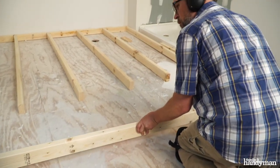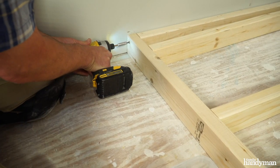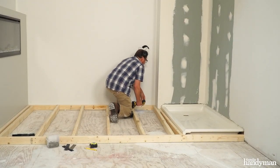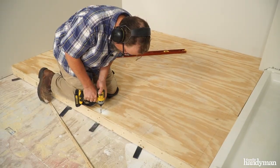I'm going to start by building the tub deck. Build the floor deck using 2x4s, 16 inches on center, as if you were building a stud wall. I trimmed these 2x4s down a little bit so that they'd be the right height. Fasten the subfloor to the framing. Now because this is a bathroom, we also apply two moisture barriers.